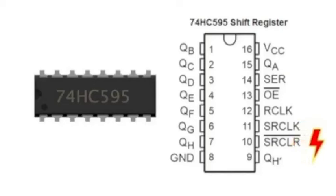Pin 13 is called your output enable. When it's powered by the negative rail it makes the bit go low — so it goes to the negative rail. This has to do with shifting bits. Really though, all we're going to worry about is playing with pins 14, 12, and 11.